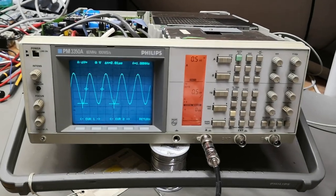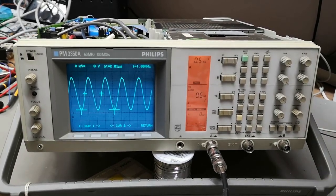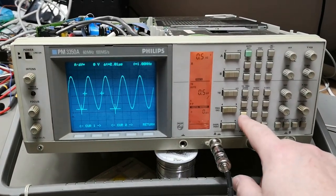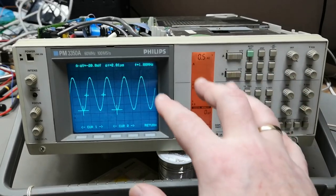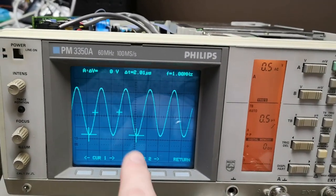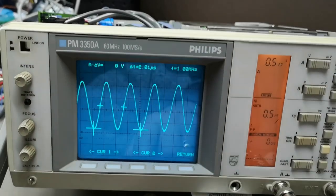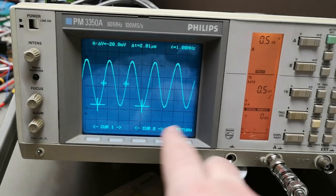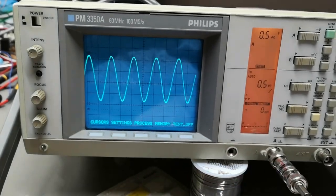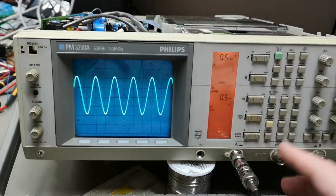There's a very cool digital menu system with full storage and all that. This is a 1 MHz sine wave signal - all you do is click here to switch between the digital and analog scope. In digital mode we've got cursors, automatic frequency measurement, and you can place cursors manually. You can do calculations, zoom in and out - it's really really cool. Then you go back to analog mode and it's completely different.